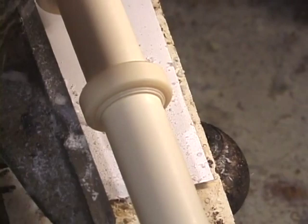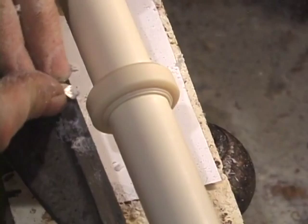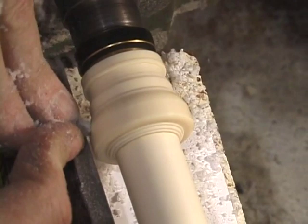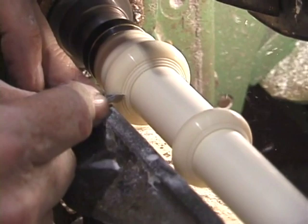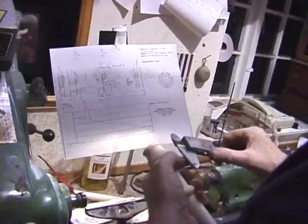Now we'll do some more work, gradually getting more form into the lower C foot joint, which has got three large bosses. Take the various keys. Form is further developed, beginning to look something like what we see in the original. Remember, I'm making this flute at a lower pitch. Instead of 415, I'm making it at 392, and somewhat stretching the whole acoustical design.